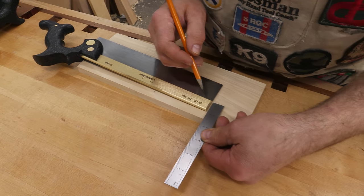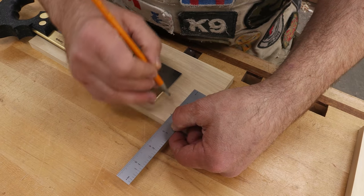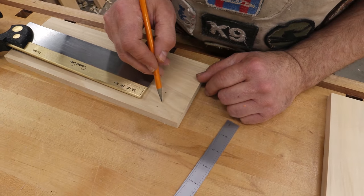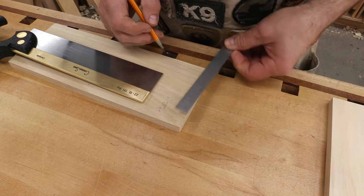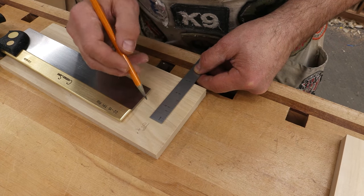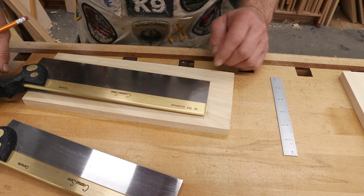The piece of brass on this saw is seven-eighths of an inch wide, and on some of my saws it's up to an inch. I'm going to start at the half-inch mark and cut down to about an inch and a sixteenth. This is a quarter of an inch thick, so I need to take at least an eighth of an inch off each piece, but I want a strong eighth so it's not jammed in there. We also need to allow for the blade — we'll come down to where we are five-sixteenths of an inch off the bottom, which will accommodate the deepest saw.